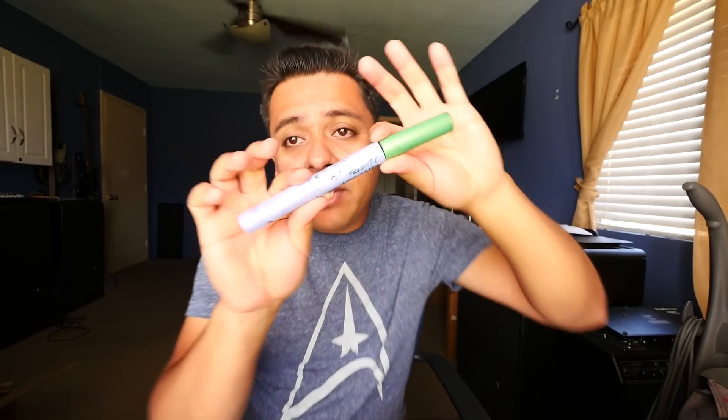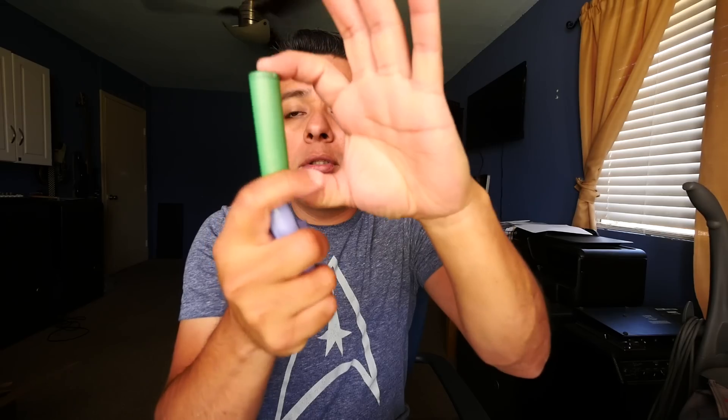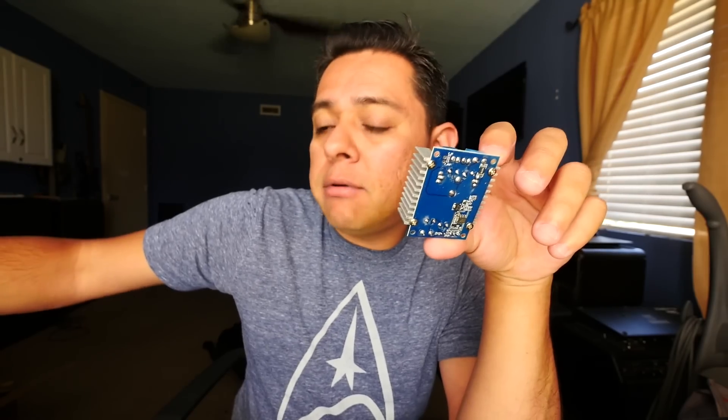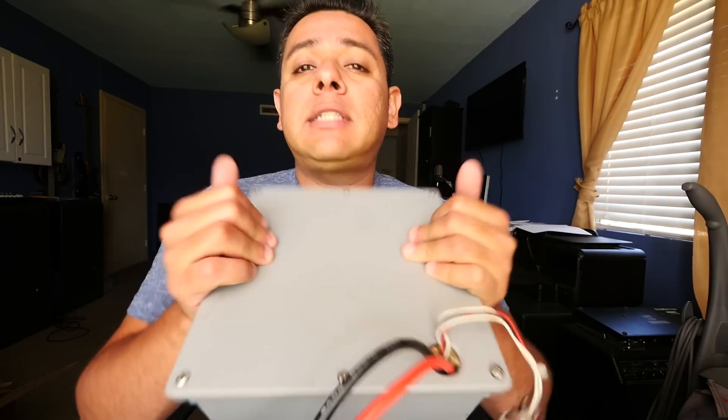My Samba has a group of cells — essentially three cells in series and 33 in parallel, so 33 groups connected in parallel and three of those groups in series. That makes it an 11.1-volt nominal, 12-volt battery. I have one of these wall adapters pumping 12.2 volts into this battery, and it's been working like that for over two years now. I haven't checked if any of the cells have drifted, so let's do that right now — let's take it apart.